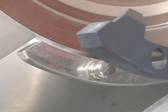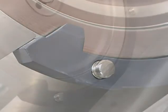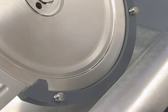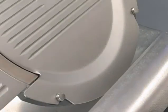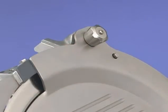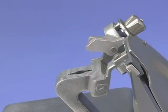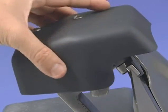Carefully reassemble the plastic ring cover by putting it in position using the 3 guide pins. Carefully reassemble the top knife cover by putting it in position over the plastic ring cover using the 3 guide pins. Secure both ring cover and top knife cover by turning the latch knob counterclockwise while lowering the knife cover. Release the latch knob and turn it clockwise until snug. Reassemble the sharpener by lowering it straight down so the rod and pin fit the slot on the sharpener mount.